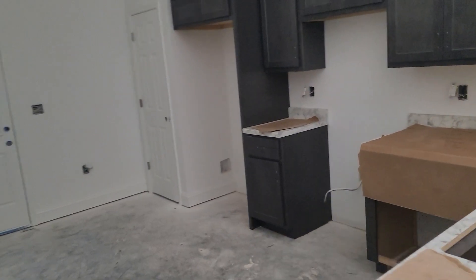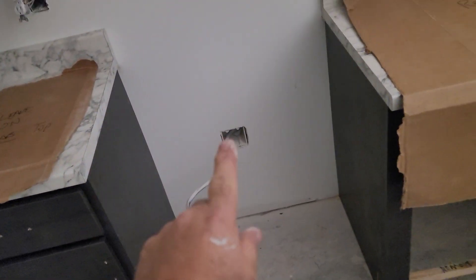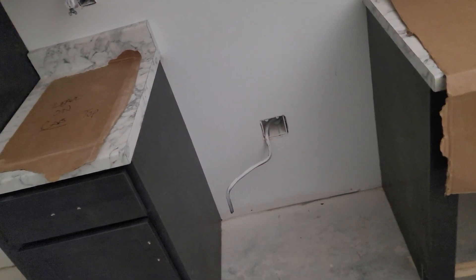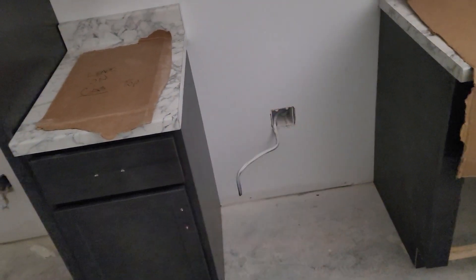The one thing I did notice today, most significant, is there is no outlet or wire above here for a microwave. We did leave our touch-up kit for the countertop up here, but there was no power that I can tell that was pulled for the microwave. The other thing is the 220 electrical for the stove is a bit high. I'm not sure if it's going to get in the way of the back of the stove — normally they're way down low because the stove can push all the way against the wall.